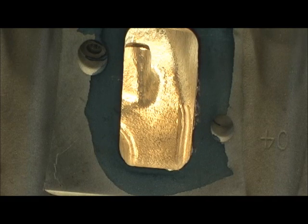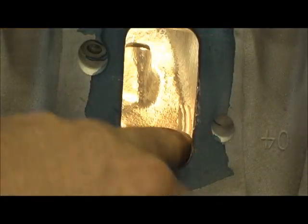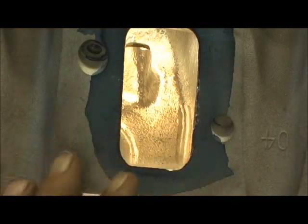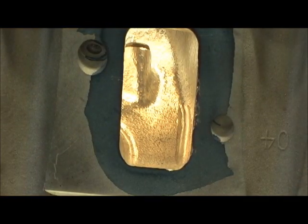I'm going to go in here now and get ready to do the raw cut as soon as I get the rest of them leveled the same way. I know I've gone over it a thousand times, and I'll go over it a thousand more: do one mod at a time with the tool that you've got. That way you keep consistency — the pressure that you're holding down, the direction that you're doing your cuts. One mod at a time, so that when you're on the last one and you're done, the entire head's done.